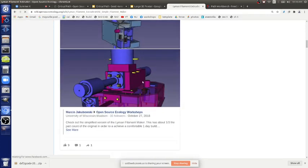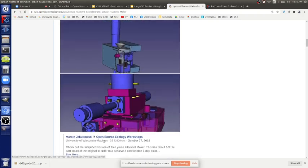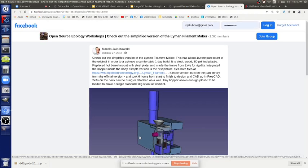So here's one question that's slightly aside. Is there any reason to not use a bigger diameter bead of filament? No, there is a case for it. I would make our next extruders go from 3 to 5 millimeters, which doesn't exist. More grab surface, and you could potentially feed faster.